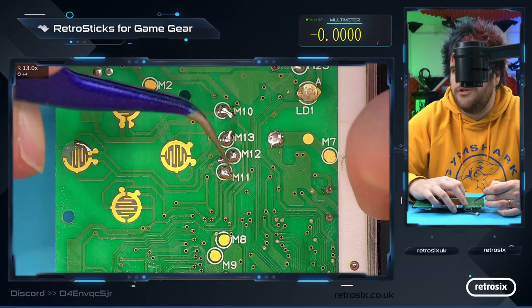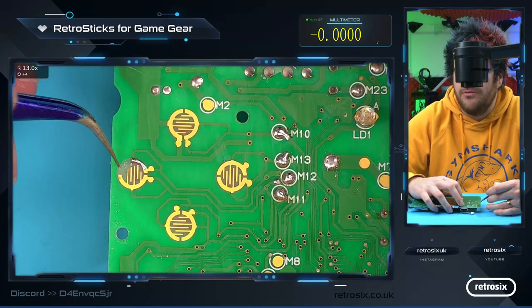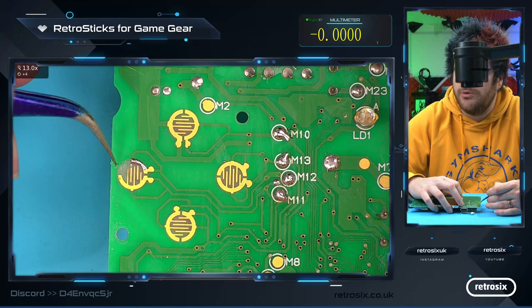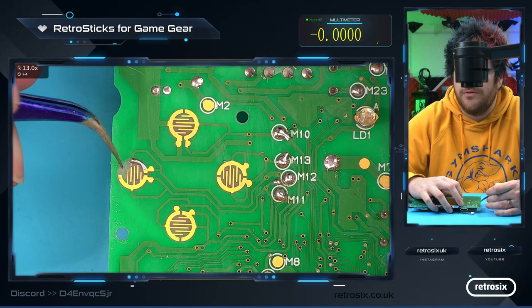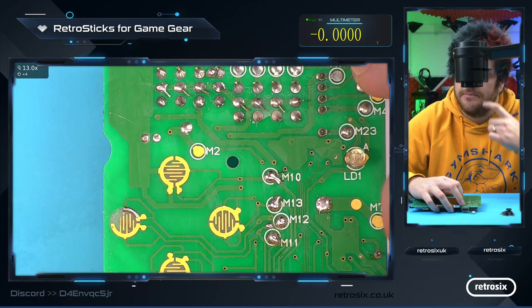So there's your 4 pads you solder there. You solder 5 volts here, and then you'd normally solder here. And I'll give you some guidance on removing it as well, because when one of the guys was removing it from the board, this will still function because you've still got the pad here connected to ground. So this will still work. But because we've torn the ground there, we're going to just wire the ground up to this pad here.